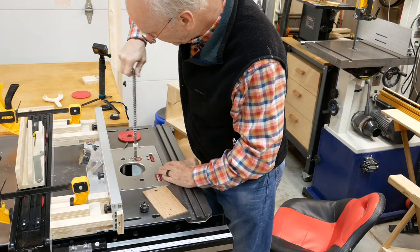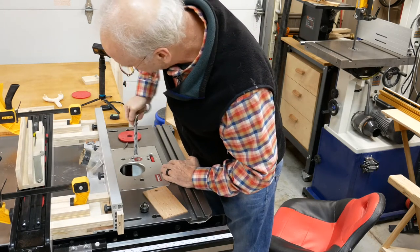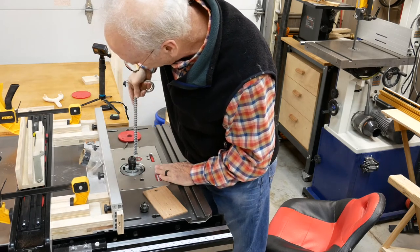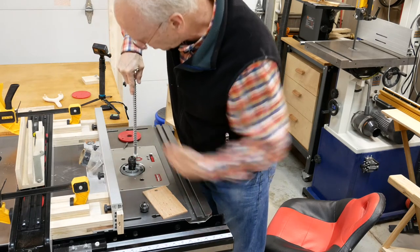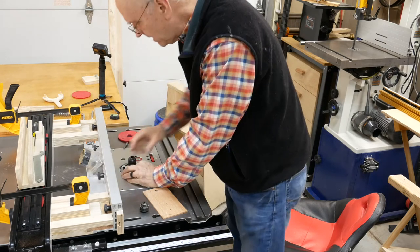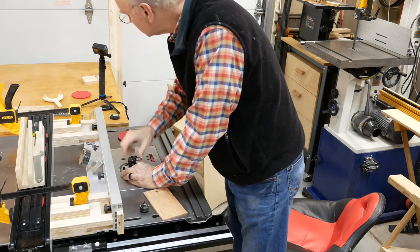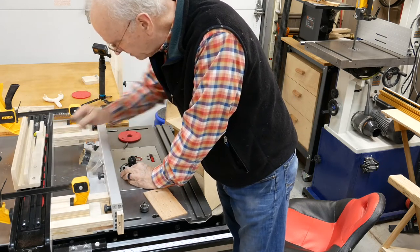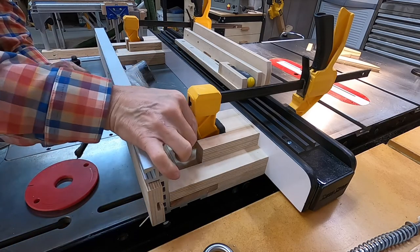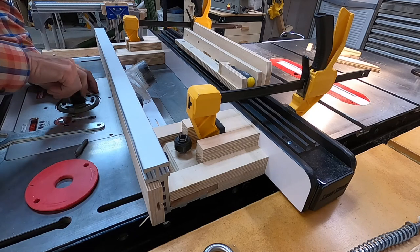And if I push that flat down, it'll engage at the bottom, and I twist it, and once I've got it twisted, I can pull up with it, and then I take the flat and point it back towards me, and that locks it in place. So I'll put that right. This screw is held in there. I mean, the collet is held in there, so I should be able to just take this half incher off of there and put this quarter incher right in there.